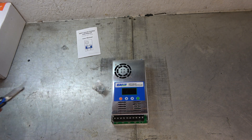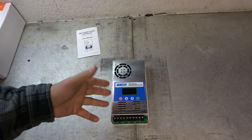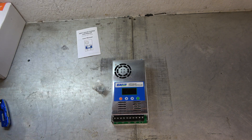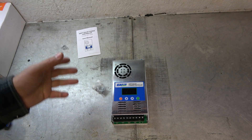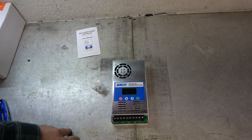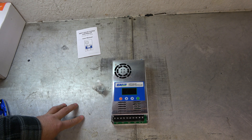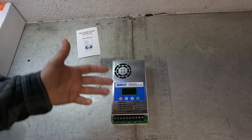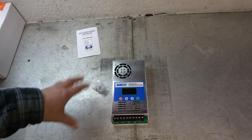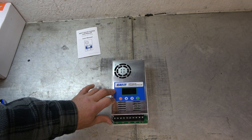For paneling, I don't have the panels purchased yet. I'm thinking about 230 or 250 watt panels instead of 100 watt panels. With 100 watt panels I can get them for about $75 each with free shipping, but if I move up to a 230 watt panel, I can get used ones for $30 to $40 — except the shipping is insane, like $300. There is a place about 6 hours from here that sells them at that price, so if I drove down I wouldn't pay shipping. If I picked up 4 or 5 panels, those are 24 volt panels and I'm good to go.